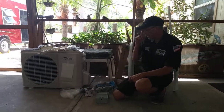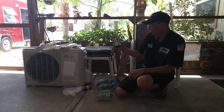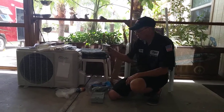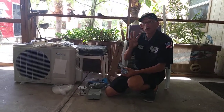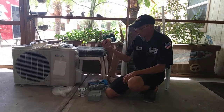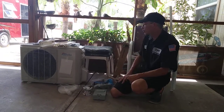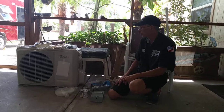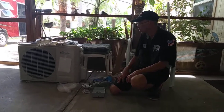One thing I wasn't very happy about was that the unit did not come with the wiring to go from the inside to the outside. So I bought 50 feet of 12-gauge wire. You have to run four wires from the condensing unit to the air handler, so I bought marking tape so you can label each one and know which is which. It's a 410A system and it's a heat pump, and we're going to show you the before with the trailer and then tomorrow hopefully we'll have the install done.